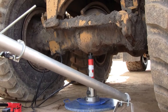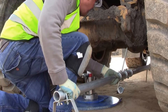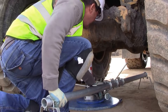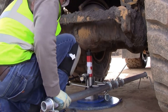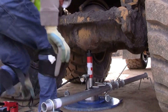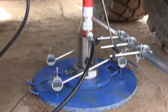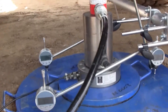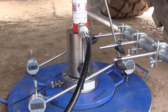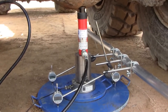This is the two-metre-long datum bar with the dial gauges already attached. We put that roughly into position and then move the dial gauges to get them all resting neatly on top of the plate. We have the three dial gauges in position, spread across the plate, and the test is just about ready to start — we just wait for everything to settle down before beginning the first loading increment.